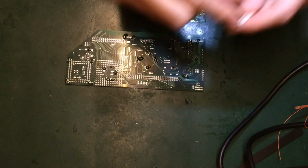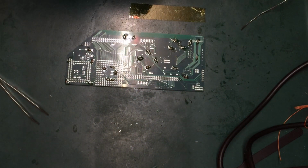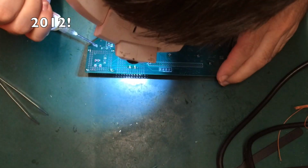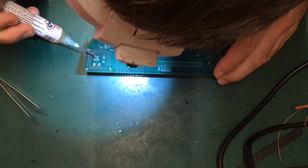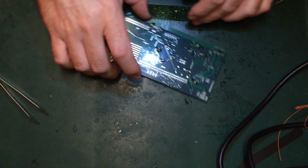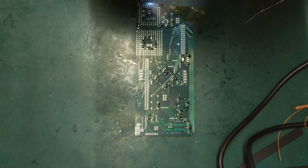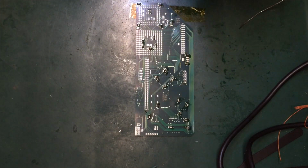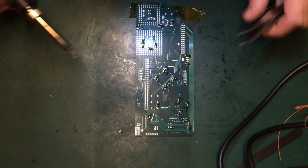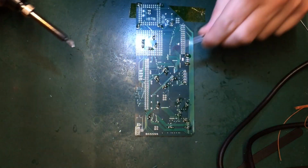These SMD components, by the way, these are all 0805s. I can't remember what that is in the metric. But these aren't too bad to do if I was working in a much tighter space. I think, for example, on the ST booster I'm doing, where I'm trying to fit it all into almost the same size as a 68,000 processor, then going down to the 0603 might be convenient. But I've got a big book of 0805s, so that's what I'm going to use until it becomes an issue.